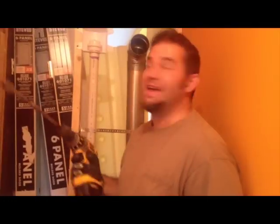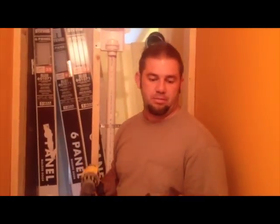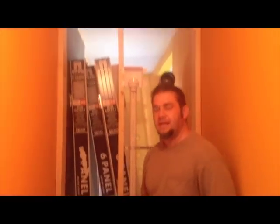On today's update, I'm going to show you what I'm doing to make a washer-dryer closet. I've taken what's normally a hallway, and I've decided we're going to stack the washer and dryer in here. I've got to drill up through here because I need to run the new heavy-duty wire to enable the 220 circuit that the dryer's going to necessitate.